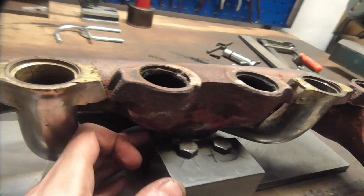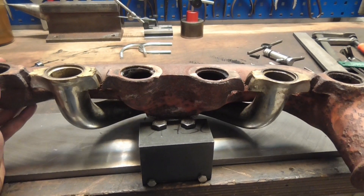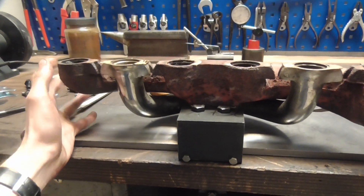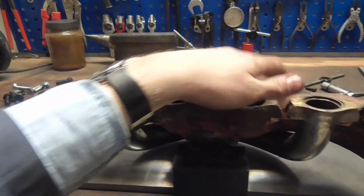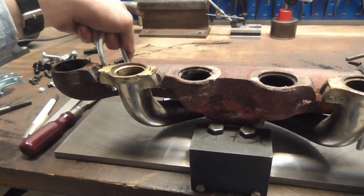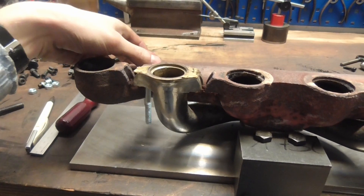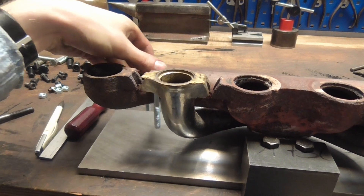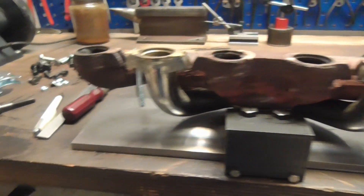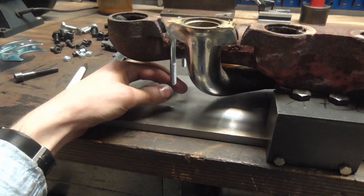The thing is strapped down onto this piece here, loosely, and you can see it's purposely got a little bit of tilt play so that I can get this thing level and set up in the shaper. Now I'm going to have to figure out how to clamp this down. I've got these exhaust clamps — going on like that. By making them a little large, I can now space these in a rather wide range, drill the holes for that, and have pins come out from the bottom to act as nuts.